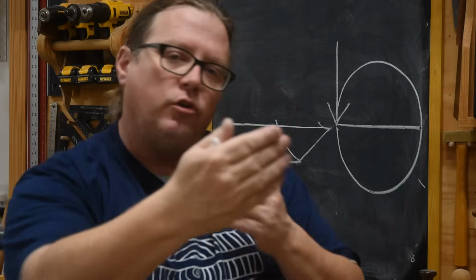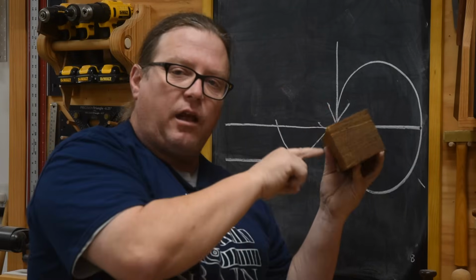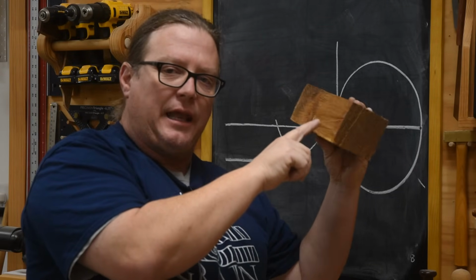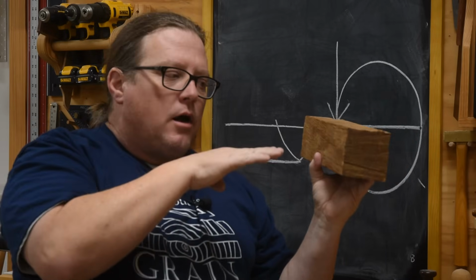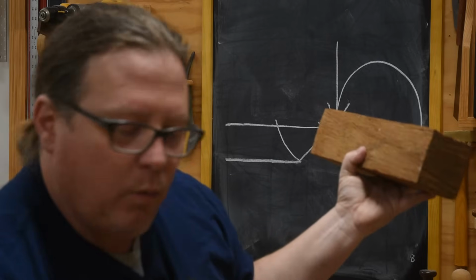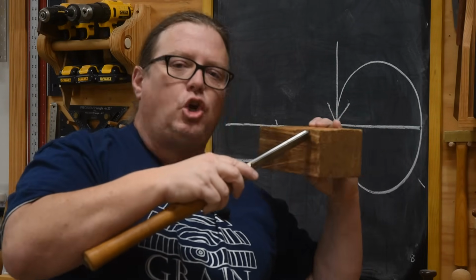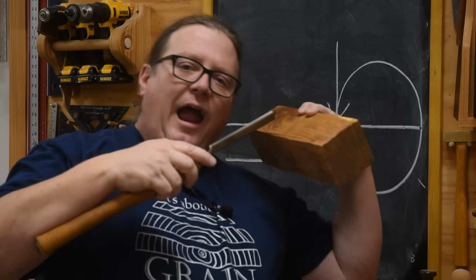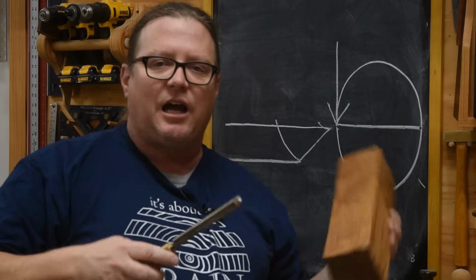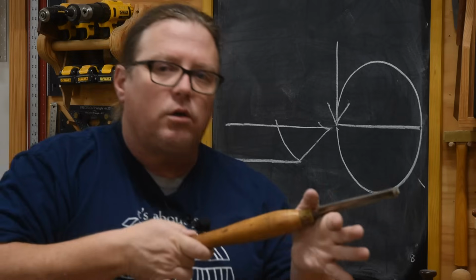This is one of those situations where you want that to come all the way down. You don't want any pressure coming back, because in this situation, we are taking off these corners. So a lot of times you're turning air, and then it hits a corner. Air, hits a corner. Well, if you have any need to put forward pressure in there, what will happen is the tool will actually move forward when it's turning air, and then it's going to take too big a chunk. And then even more power is going to be transferred down into your arm, and then it's going to go in the air, and then you'll be even deeper. It'll take a bigger bite the next time. And it's just a lot more aggressive if you're pushing forward with the tool into that.